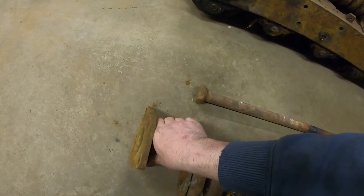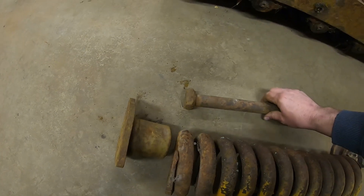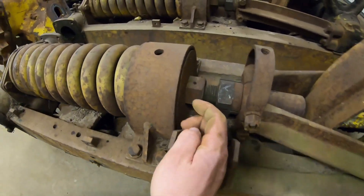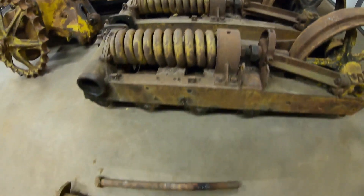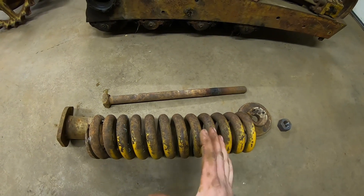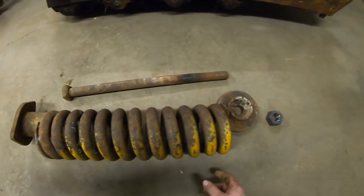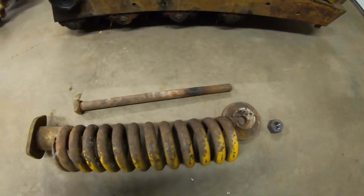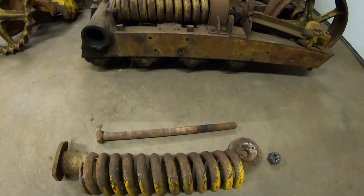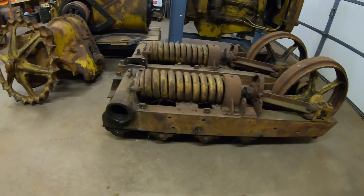Because it's so deep, that bolt can drift forward and back a couple inches in that end plate. You have the front plate and the nut which tensions this whole spring. You set these up to an assembled length of 17 and 1/16 inches from the flat machined face at the back to the flat machined face at the front.